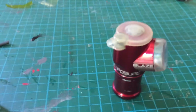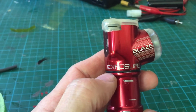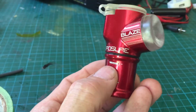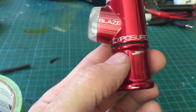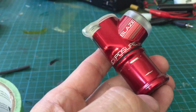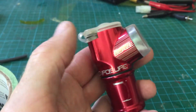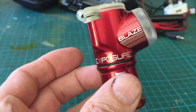So the next thing was to work out how to get it apart. Basically the Blaze comes apart at that joint there, but getting it apart is an utter bastard. First I tried mole grips with some rubber around them — scratched it there and there. That wouldn't undo, so finally I had to stick it in a vice with rubber on it, and also use a big adjustable spanner with rubber to rotate it. It was difficult to undo, but it's now semi-undone. If anyone knows a better way of getting it undone without scratching it to bits, let me know.